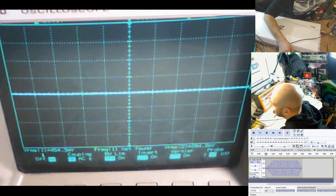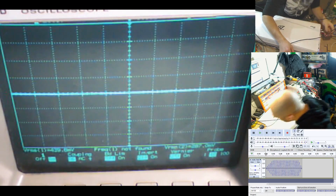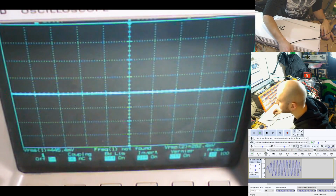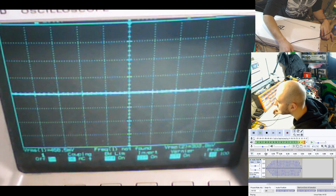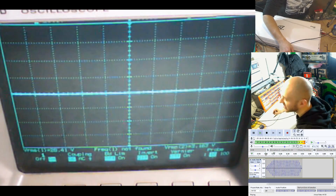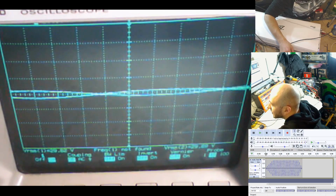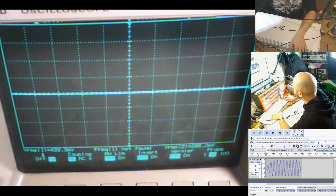Okay, now let's start increasing the gain a little bit on the head unit until we're both clipping equally. Okay, channel 2, a little bit of extra clip, so let's back off channel 2 a little bit. So we backed off on channel 2, so now we just increase the gain on the head unit once more. Okay, there we go. So we're now clipping equally. So let's find our exact clip point.